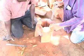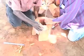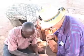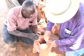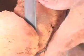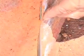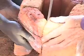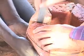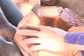And you see your angles are pretty good, so your mold was pretty successful because the bricks shrank about right. It could be just a hair different, but it's definitely very good. And see here, I'm getting the slight warpage in the brick to be straightened out by the abrasive on the blade. And we'll do this just a little bit too.